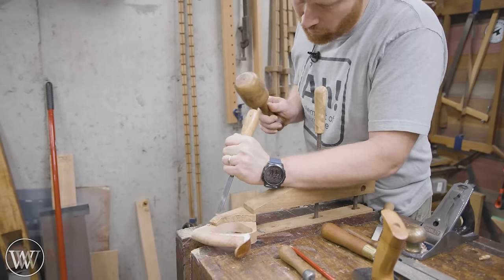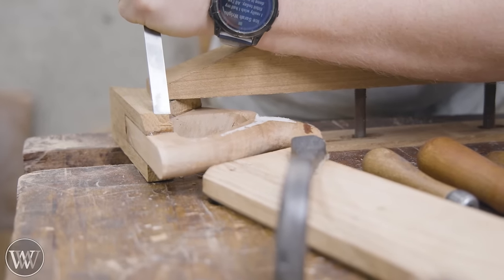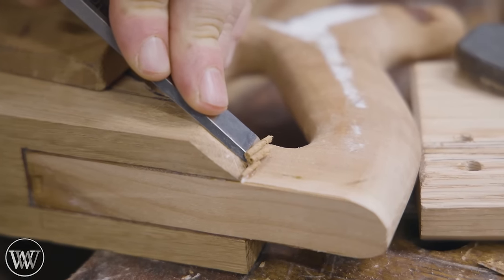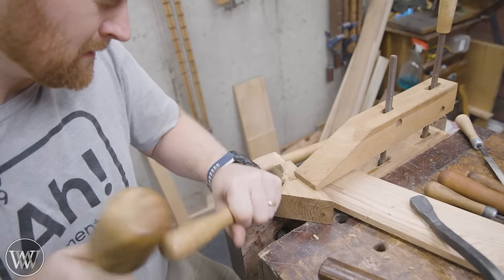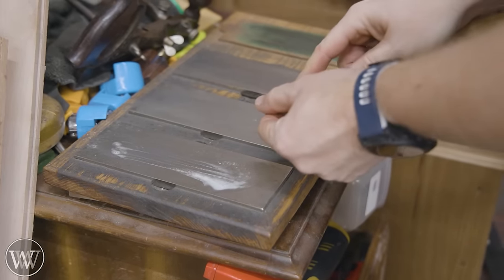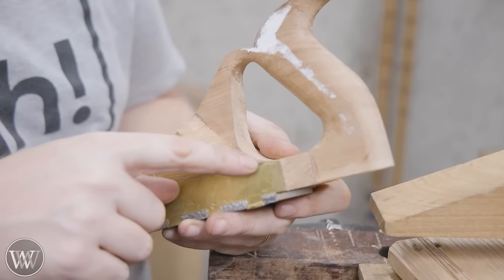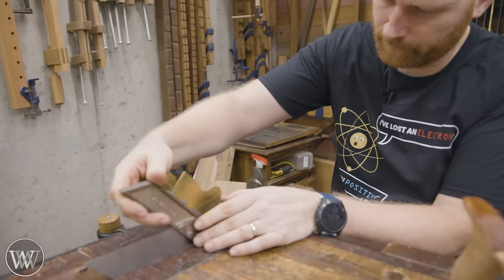I was having a problem with this turning as I was chiseling, so I brought over a holdfast and a block of wood to stop it from rotating so I can drive in. I'm going to take off large chunks with the chisel beveled down, and once I get close I can come in clean and file it up. I love these small curls coming in and getting that nice transition down to the bottom. On the sides, I'm putting in a chamfer that will transition from the brass body to the wood body, drawn out where the brass body intersects. You want a really sharp chisel here — a dull chisel means more force, and more force means you're going to be blowing things out.